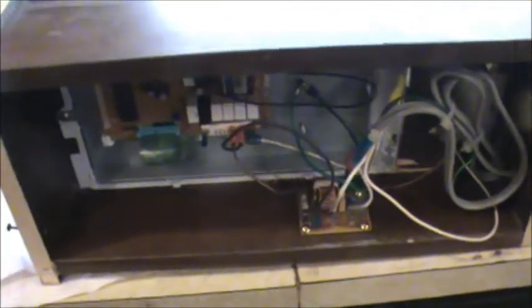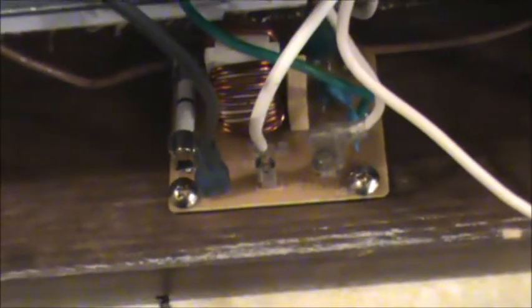I have the unit laying on the bench and there are actually two circuit boards — there's one up there and a smaller one here. This is called a filter board and it has a fuse on it. Because the power coming into your house fluctuates a little bit, this is supposed to smooth that out so you have a consistent 120-volt AC current going through this board. I have a plug that comes into this board — the neutral ties in here and the hot wire comes in on the back side, goes through the board and through the ceramic fuse, and coming out you have a hot wire and a neutral wire. Luckily this board was labeled, so it was pretty easy to figure out, and I did have the schematic that lists this filter board as well.